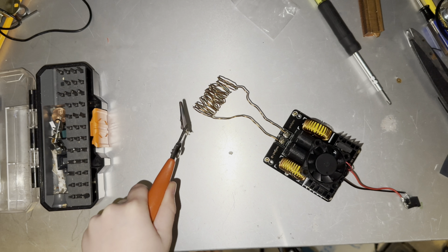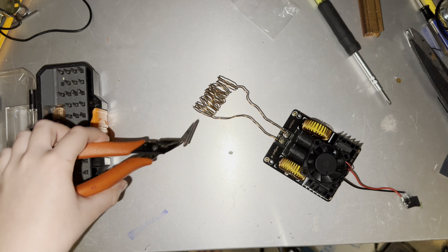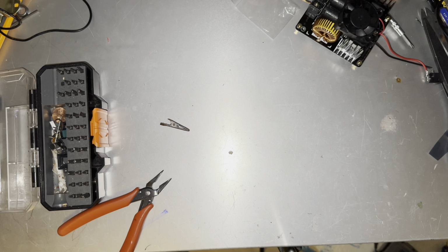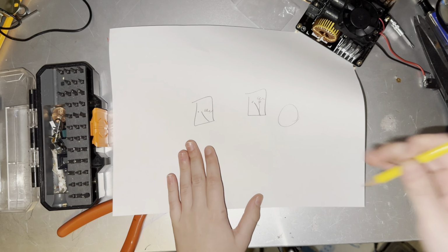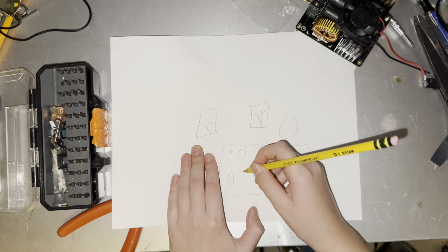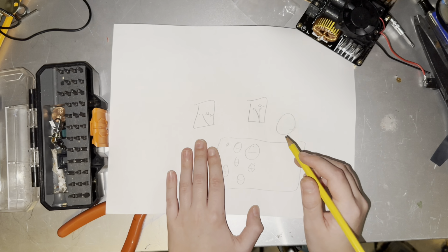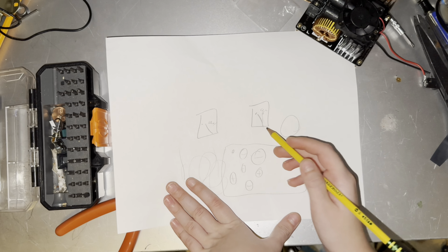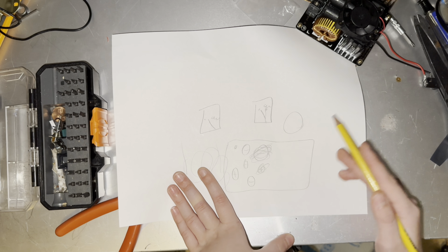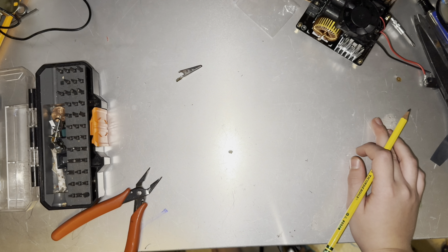Yeah. This has to get to at least 1,000 degrees. Maybe even more. It's magnetic? Oh, right, yeah. This literally just produces a bunch of magnetic fields. Because you gotta think, right? Here's how it works. Here's my sheet of paper. Basically, imagine this metal, right? I didn't explain this one very good either. It's pretty simple though. Atoms in the metal, magnetic. They move around according to the magnetic fields, and they twist and move around, and friction goes in between them. And they start shaking really hard, you know, like when you heat up something. Except the magnetic fields that are alternating cause the friction, which causes heat. That's how induction heating works.